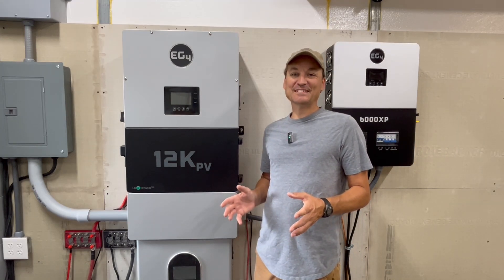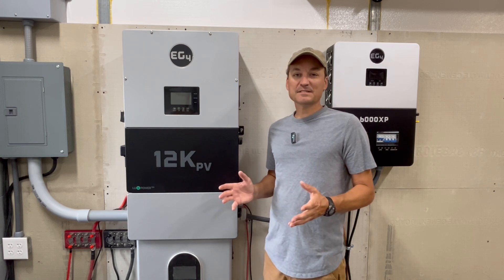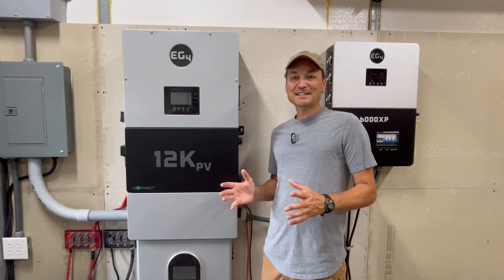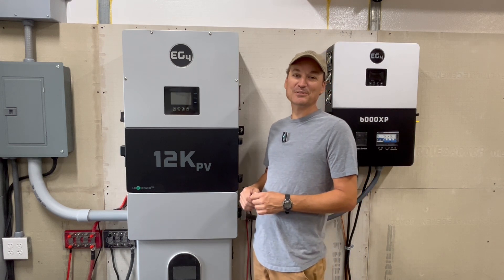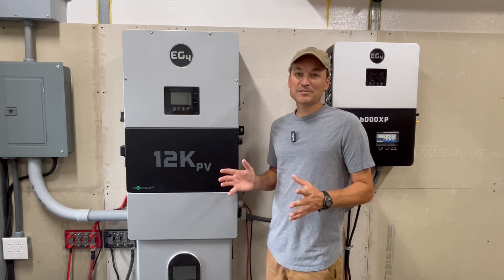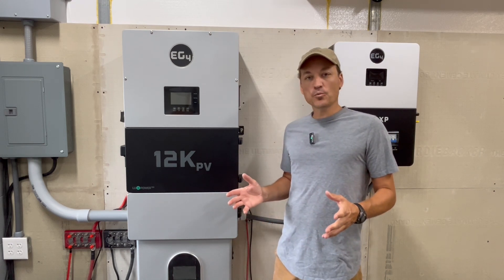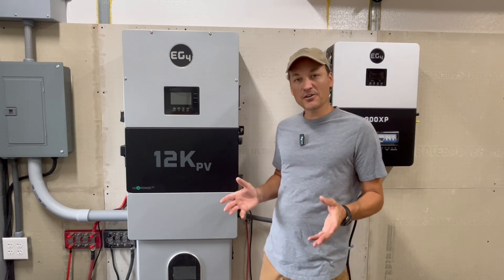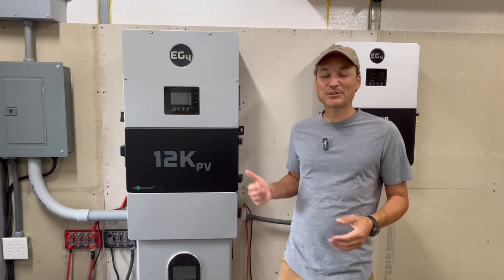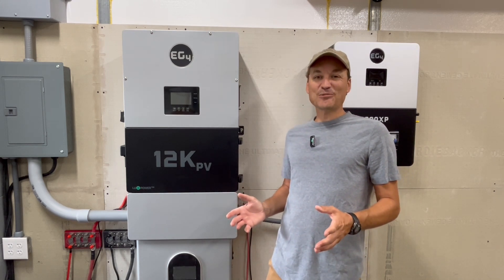There's a lot to cover with hybrid inverters in general, especially with these — they've got so many different options. Something I neglected to mention in the last video is this inverter has an 80 amp pass-through. So even though it can output 33 and some change amps, you can actually pass through 80 amps from the grid through this inverter. I'll leave a link to this inverter down below in the description. This thing is a real workhorse — it can take a large inductive load and consistent loads well above the rated output. I'm going to continue doing other testing and stress testing and checking other features on it. Hopefully this video was helpful — I appreciate you guys watching and stay tuned.